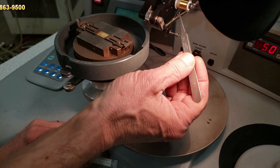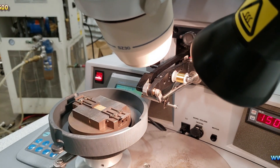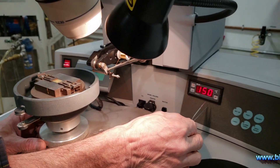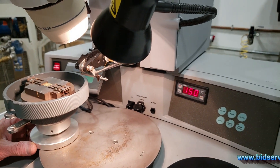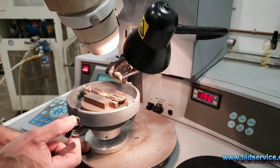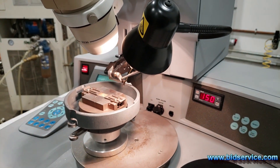This is using a half-inch spool of one mil gold wire. If you heat the work stage here with your temperature controller on the right, it's recommended you set your temperature for gold wire bonding to 150. This is being mechanically held down by the use of clamps. You put your device in here and clamp down on it.